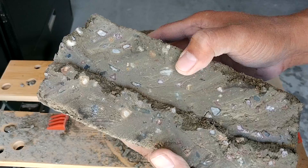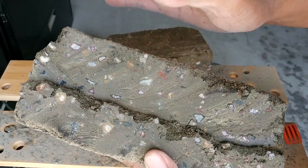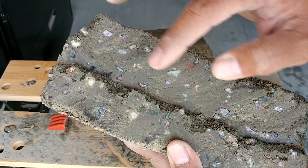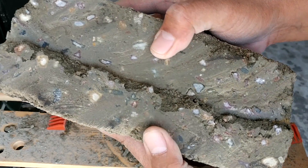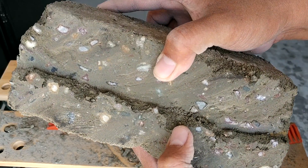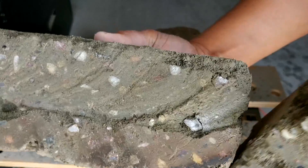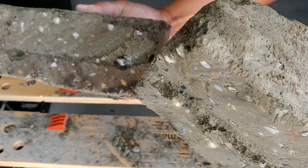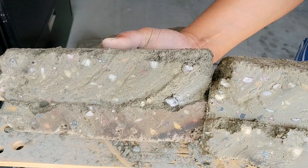This is the one that was misted lightly at the beginning. It looks like all parts of the concrete are hydrated properly. You can see this one took more watering rounds compared to the other one, and it's still curing right here — but they both look solid. The saturated-from-the-start one and the lightly misted one — they kind of look the same on the inside.